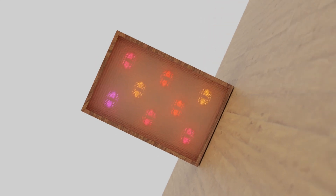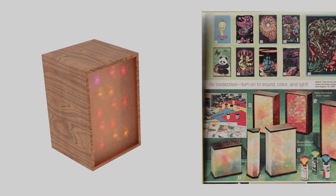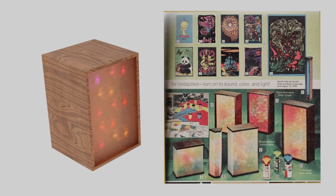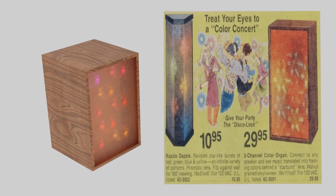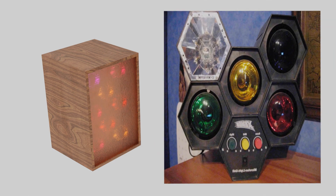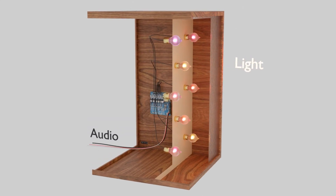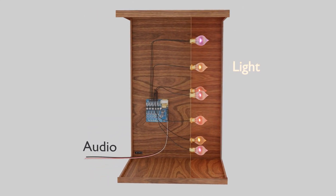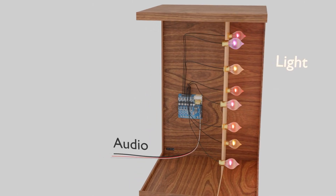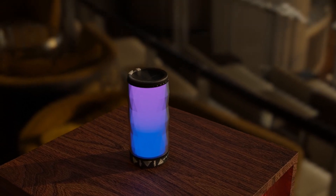Well, this is a light organ, also known as a color organ. It's an entertainment device from back in the 70s which gives an easy way to add a light show to your music — promising a color concert with not only razzle, but also dazzle. These things come in a couple of different variations, but basically they all work the same: take an audio input and use it to modulate the power arriving at different sets of colored lights, so loud sound equals bright light. That was pretty exciting back then, but today that's just kind of what a lot of Bluetooth speakers already do.